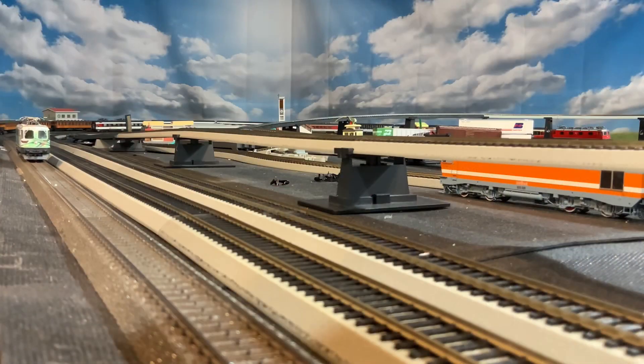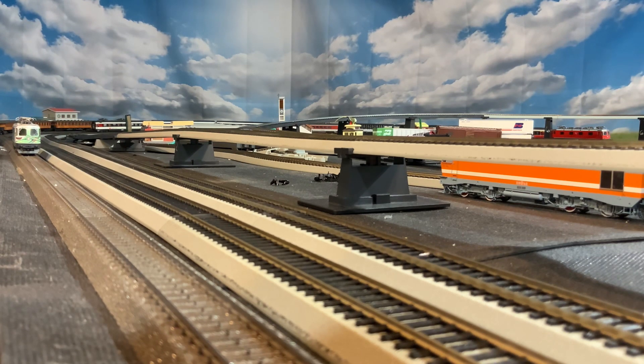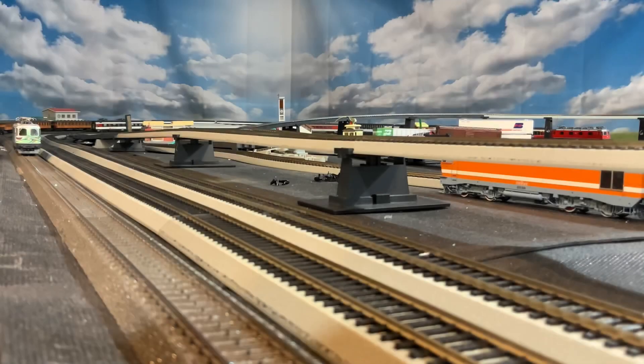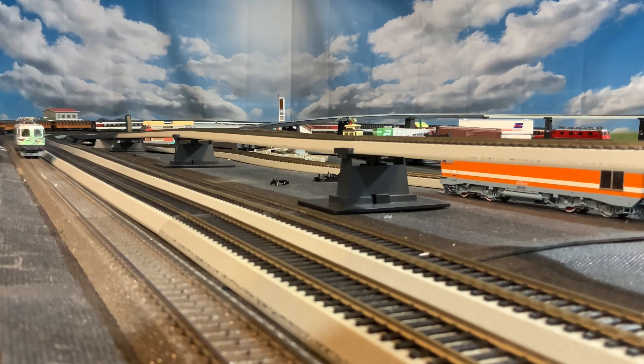We were able to convert this AC locomotive into DCC with just one extra part for under a dollar. Of course you still need a DCC decoder, but this technique will work with any DCC decoder — just be careful that your decoder's amperage rating doesn't exceed the rectifier's rating. You can see me tuning it and taking my time to make sure everything lines up and works. It does have some low-speed surging which I'll take care of via the decoder CV values, but I don't think that'll be a problem. I hope you enjoyed this — stay tuned to my channel and I'll try to do more of this.